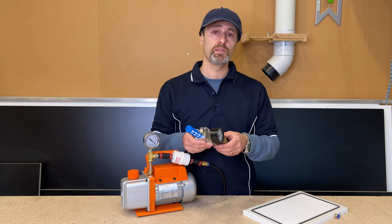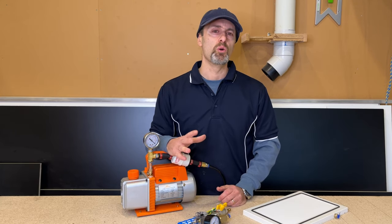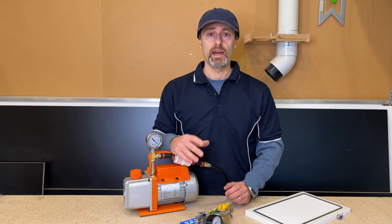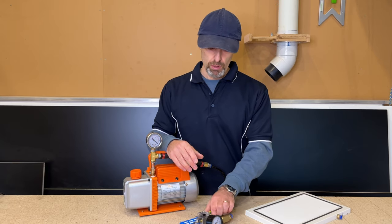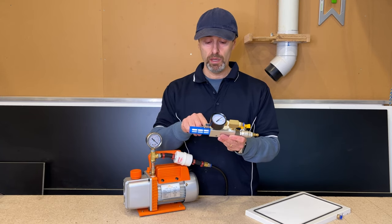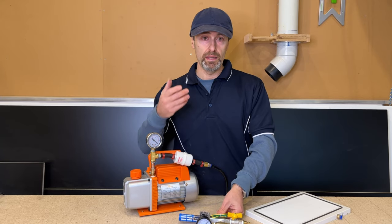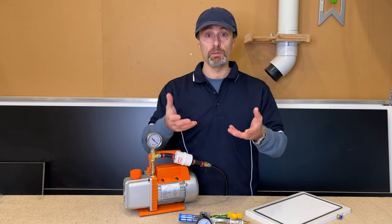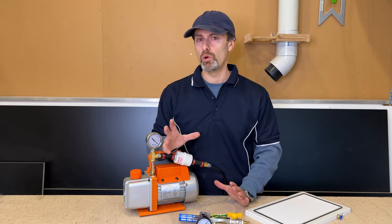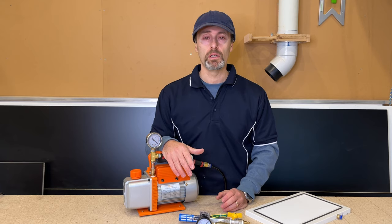I did experiment with this and it does work 100%, but for me, I've got an oldish sort of compressor, and I found that it had to keep kicking on regularly, because with this setup, it's like having, if you can think of it, a slow leak, because air has to escape and it comes out through this muffler. Eventually the air drops in your compressor and it has to keep kicking on. And like I said, my compressor wasn't keeping up too well with it. It was working, but I found that it had to kick on too often to keep this going.